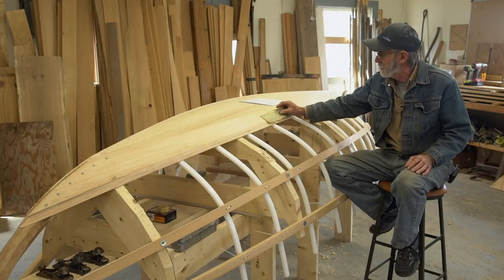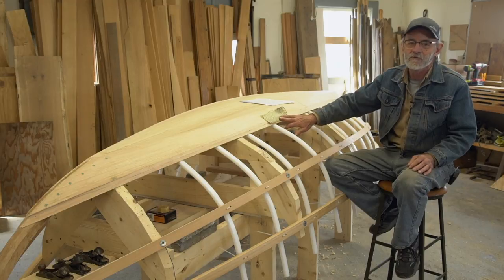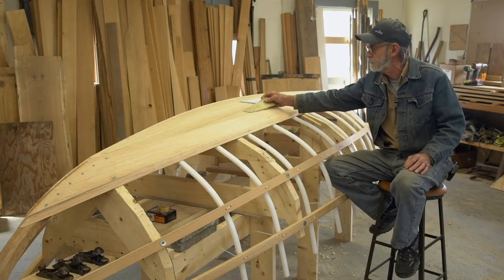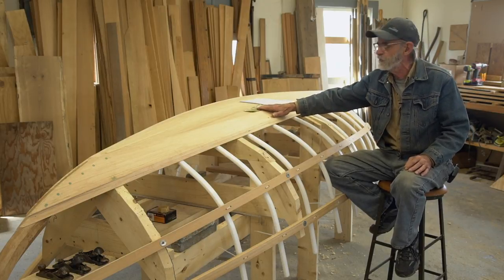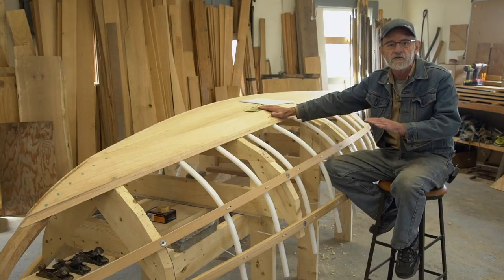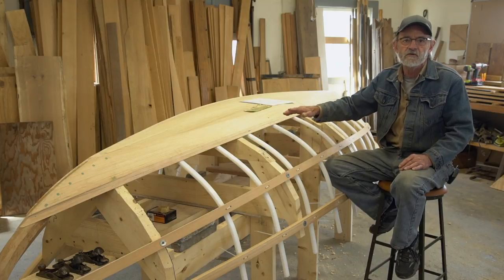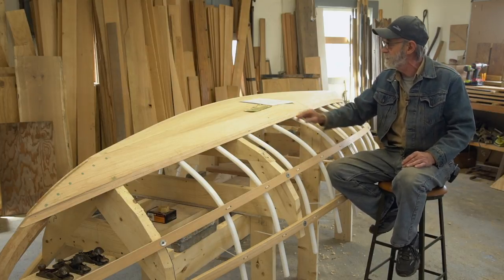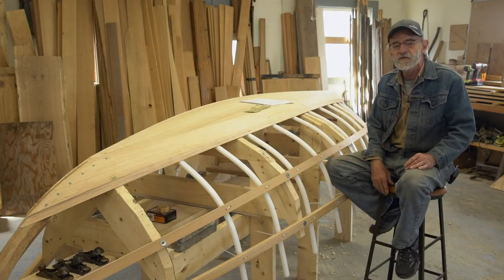It actually looks a lot better. It's got this color to it, so it looks a little bit like the color of wood, and it's going to look a lot nicer than it would if I used regular carbon fiber on the bottom. This carbon Kevlar is incredibly abrasive resistant, and that's exactly what we're looking for. So when we drag it on the beach, it won't scar the boat all up or rip at the cloth or anything like that. And believe me, it is abrasive resistant. This is the material, and that's our next video right there.